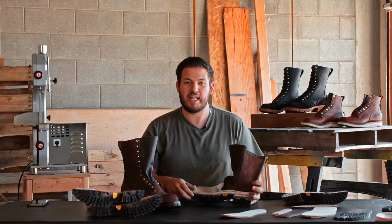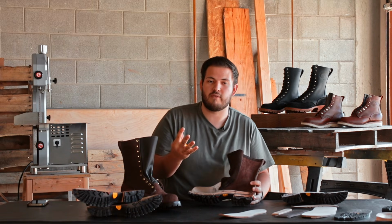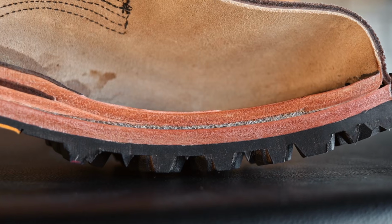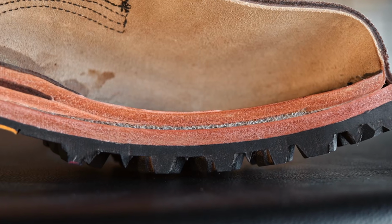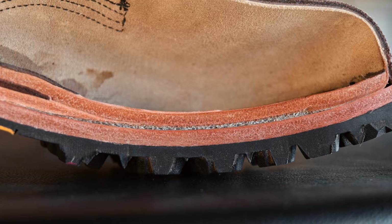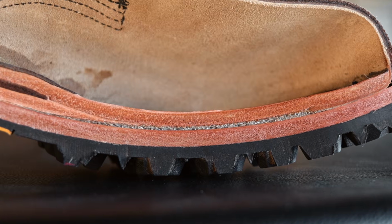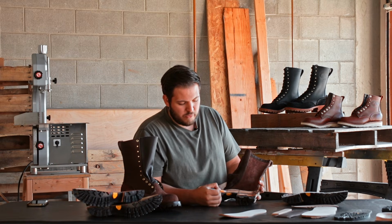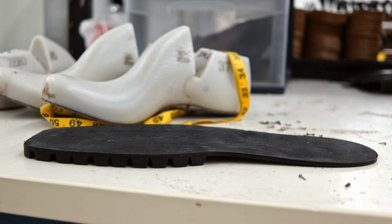And so we install that layer when we're putting on the midsole, specifically for that reason, so that it doesn't squeak. It's very thin, it's unnoticeable, and it actually acts like a little bit of compression too. So we put it right there underneath the ball of the foot, where naturally there would be the most curvature of your foot, taking steps, kneeling down, whatever. As we move forward, right after the leather midsole, we have our outsole.